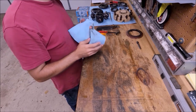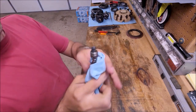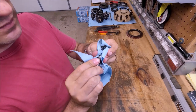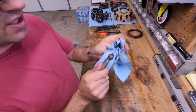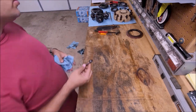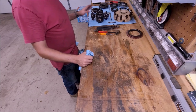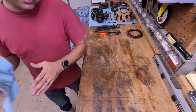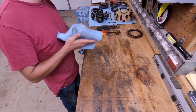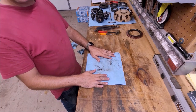I got most of the gears, bearings and stuff like that cleaned up, laid out, ready. Last thing is to lay into the hub. I wanted to go back and revisit something — I pointed out that I thought there was metal chips, but it wasn't metal chips, they're just stuck to it. It's RTV, so everything looks good. All that excess RTV was like all over the place in the bearings and on the bolts. Cleaned it all up. At this point I'm probably not going to take this all the way apart — looked at it, turned it, everything looks clean. The only thing I'll do is replace the O-rings when it gets to that point.